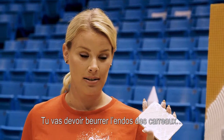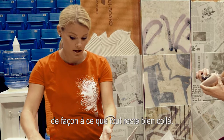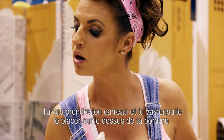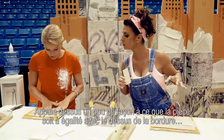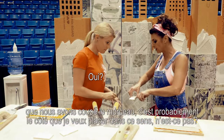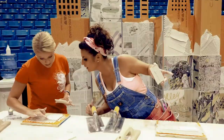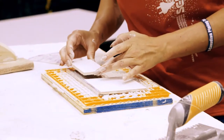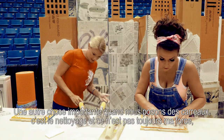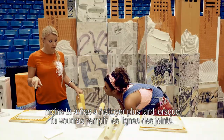You need to back butter tiles. The whole point of back buttering is just so you get a thin layer of thinset so everything sticks together nicely. You're going to take your tile and place it on top of your trim. Normally we'd have a spacer to put in here. Push it down so it's flush with the top of the trim. Since this is where we cut it, that's probably the one I want to put that way — you always hide your cut edges. See, I'm not that bad!